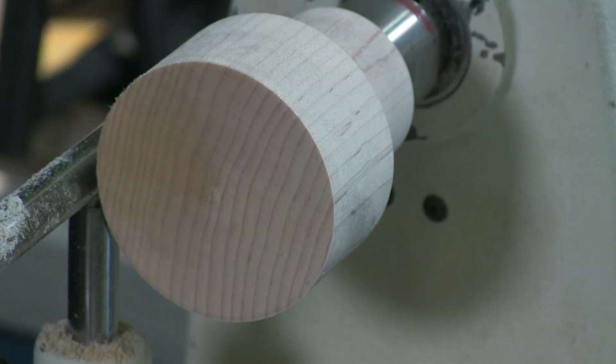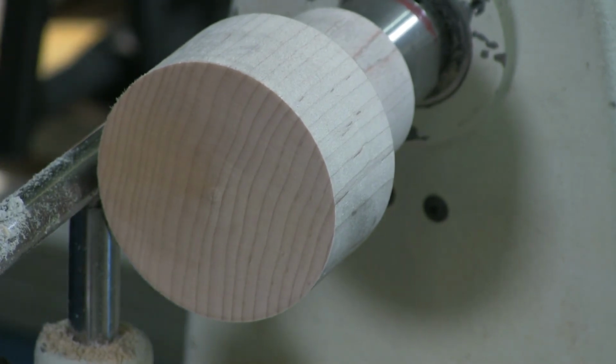This is the one time when you get a pair of calipers out. Don't use it for measuring. You want to size your tenon. So I will take that, and I usually go about 0.5 millimeter bigger than I need. No, I want to go the other way, smaller. It's a real funny look on my face when I do this wrong and I go to fit the lid on in front of 100 people. So if you go like 0.5 millimeter smaller, it gets you where you need to go a little quicker.